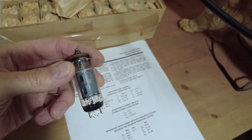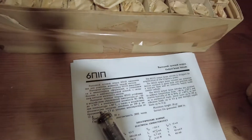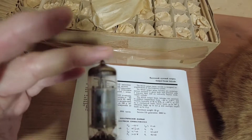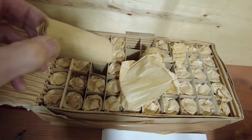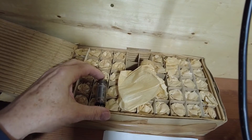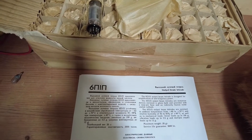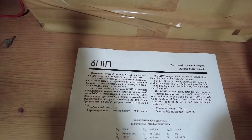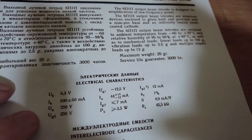Pink's here again — as soon as I start filming, here comes Pink. She's examining the goods. So here are the goods — this is the 6P1P valve, and I've got the data sheet for it here. These are Russian beam tetrode valves — very good valves. I bought a hundred of these. You can see they're all wrapped up nicely. So that is a possibility to go in — for a number of reasons: one, it's a beam tetrode; two, I've got loads of them; and three, I don't have to drill out that hole.